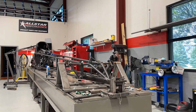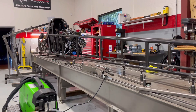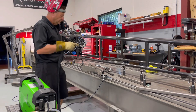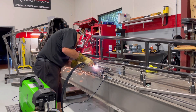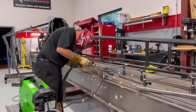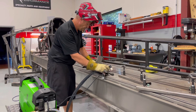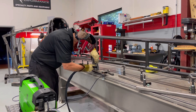As far as the update goes, as current spec you can have a 0.049 thick front end. The spacing of the bays is shorter with that, but NHRA is going to mandate a 0.065 front end. It's going to gain quite a bit of strength — the flexibility might change a little bit, and a lot of guys are worried about that. But I've got the most runs with a 0.058 car, and I ran that when everyone else was running 0.049. And that car hauled ass.